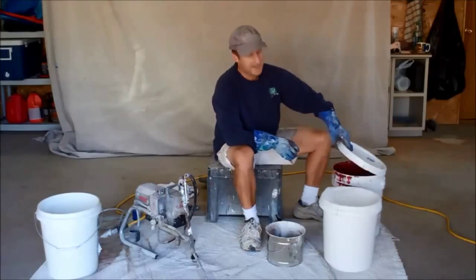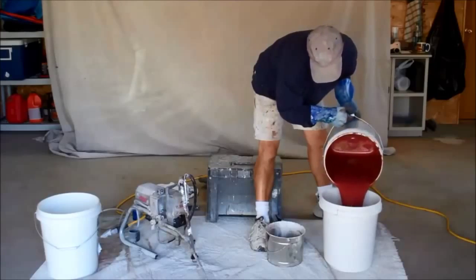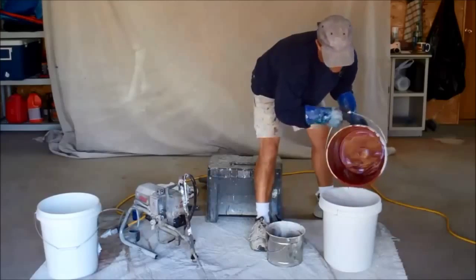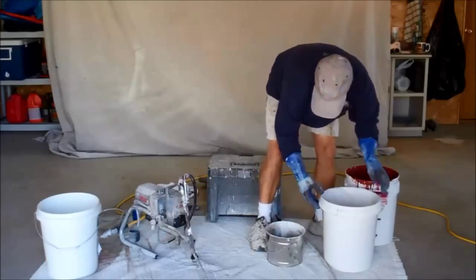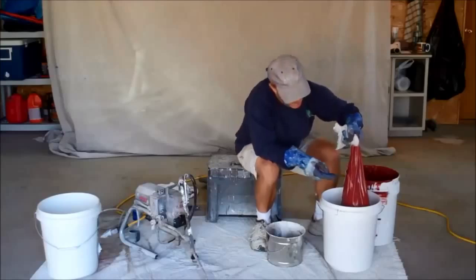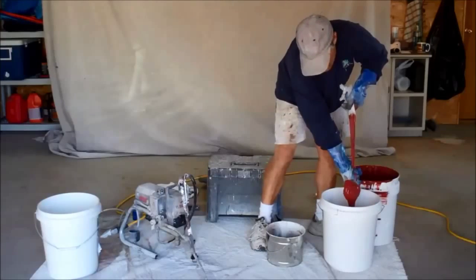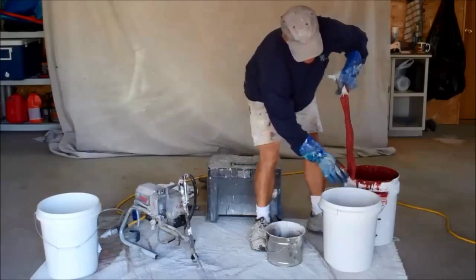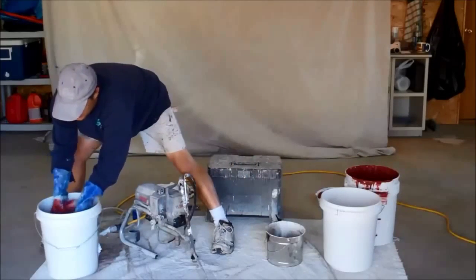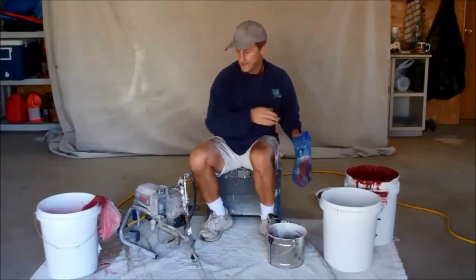All the paint I run through this sprayer, I'm going to strain through this strainer before I put it in. If you do that, you'll have much fewer problems with little clumps in the paint jamming up your gun and clogging it. First thing: take the five gallon bucket of paint, dump it into the bucket that has the strainer. Unhook the strainer from around the edges, slowly lift it up, let it drain. Squeeze the rest of the paint off the end into the bucket. Then take your strainer, rinse it in your clean water, and let it hang in there — you can reuse these many times if you clean them. Now the paint is ready to be set up with the sprayer.